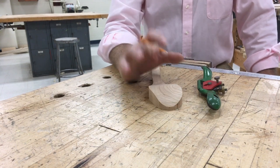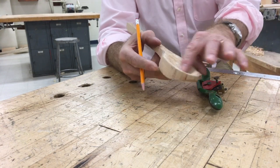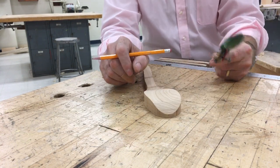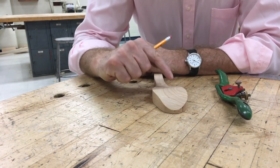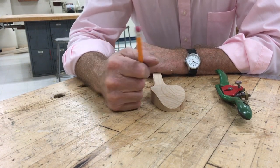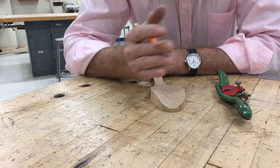In this video I'm going to show you how to shape the bowl of the spoon after it's been cut out. After you've hollowed out the bowl, we're going to shape the back of the spoon using a spokeshave. Since the spoon is more or less an oval or circle shape, we need to go in a certain direction when we use the spokeshave to cut the material away.